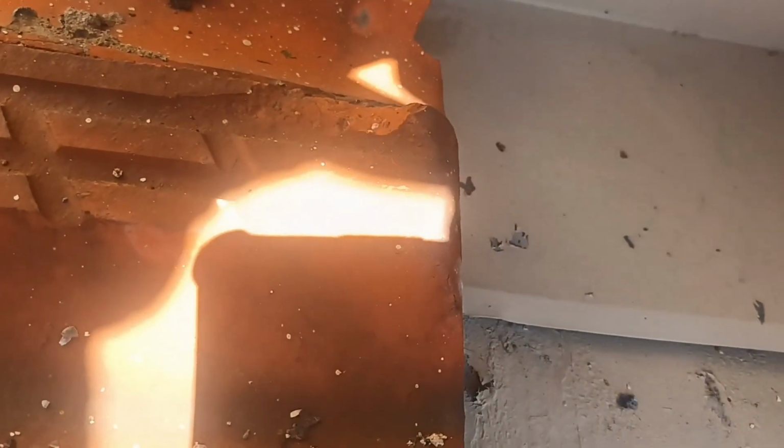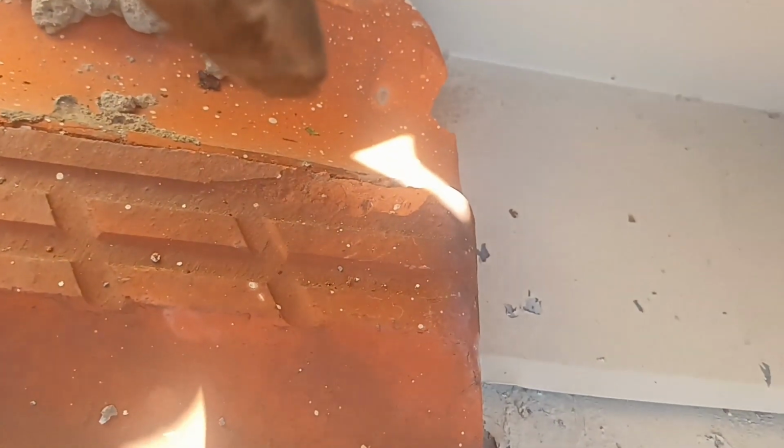I don't know if you can see it, but what he's actually done down this side of the house, and the reason you're getting the leaking, is he's used an apron that you should be using on a tin roof, rather than the secret gutter that you should be using on metal on a tiled roof. You can see exactly what he's done. He's just put a piece of metal in there, so any water that's landed on there falls down and into the roof. There's no edge on that to stop it from falling in. So whoever did that really was quite bad.